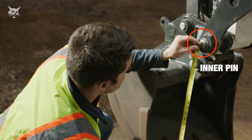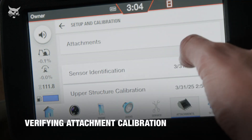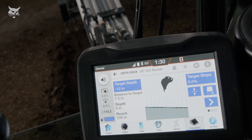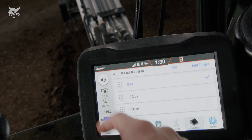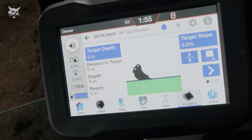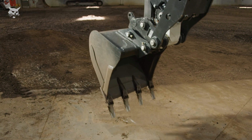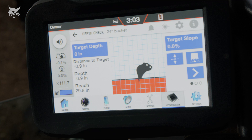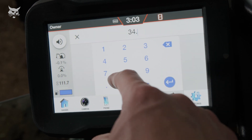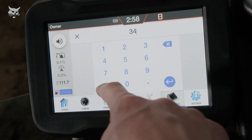If measurements during calibration were off by as little as 1/16th of an inch, it can impact the final system accuracy. After calibration is complete, Bobcat recommends verifying attachment calibration as mounting tolerances or wear between teeth could affect accuracy. To do this, set the target depth to 0.0 inches and slope to 0.0 percent after a complete system calibration. Perform a benchmark on an immovable object such as a slab of concrete with the bucket flat. Curl the bucket out so the teeth are now vertical, then place the teeth directly on the same spot as your previous benchmark. If the depth check system shows your attachment is slightly too deep, go into the display settings and reduce the outer attachment length in minor increments, such as a tenth of an inch. If the depth check system shows your attachment is slightly shallow, increase the outer attachment length in minor increments such as a tenth of an inch.